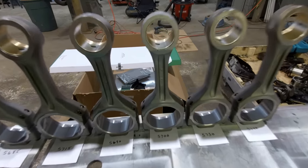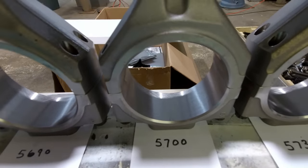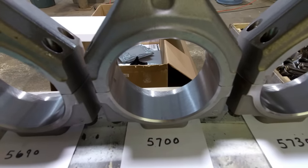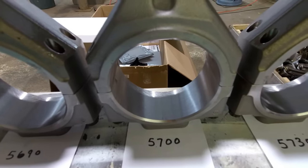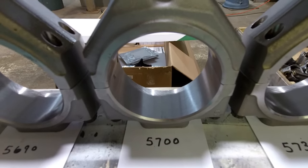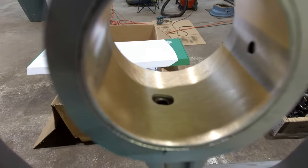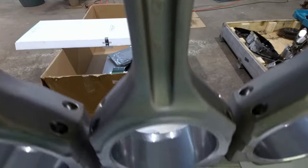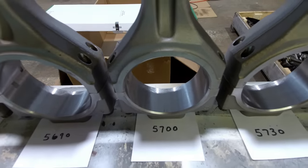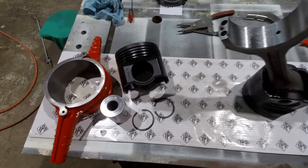This engine's getting a C15 ACERT crank. The ACERT crankshaft has got a larger rod journal than the 14.6 crankshaft. The ACERT rods are also a 4-bolt rod, where the 14.6 rod is a 2-bolt rod. And the ACERT rods have this oil hole in them that goes through from the upper pin bore through the rod to the lower bore — the 14.6 rods do not have that oil hole either. I'll show you how one of these rods and pistons goes together.